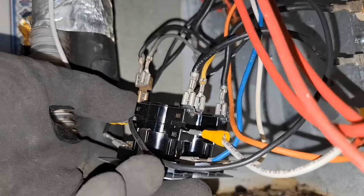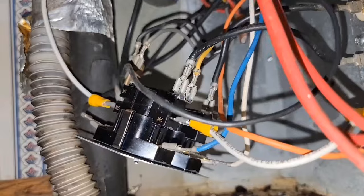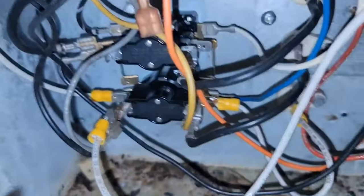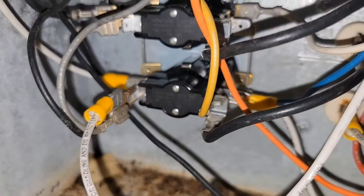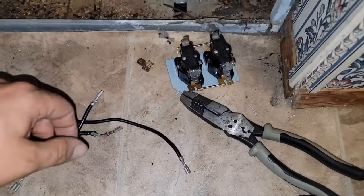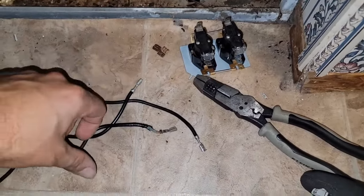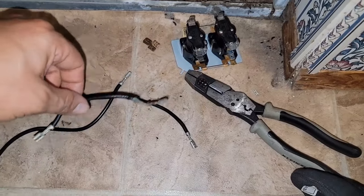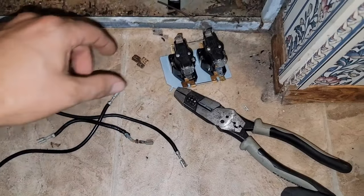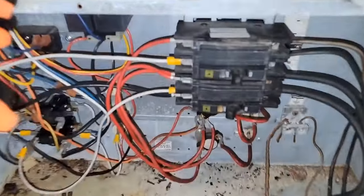Oh look at this - we've got one more burnt wire. I'm going to take that other burnt wire off. New sequencer is installed. We've replaced three burnt wires. Make sure you use stranded wire - I carry some stranded wire. It's at least got to be number 12 wire. Carry some number 10 wire, because number 12 is rated for 20 amps, and that's what these heaters are going to pull - about 20 amps a piece.